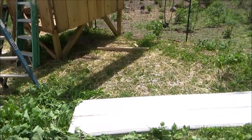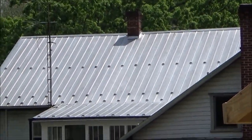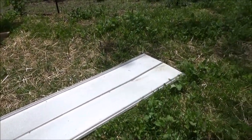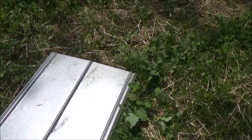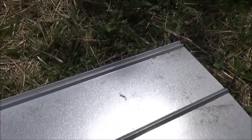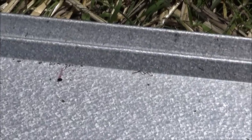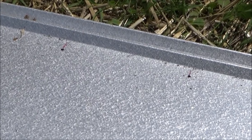This is some scrap metal that I had from the roof replacement years and years ago. Never throw anything away. So we cut these panels down to the 8-foot length we needed, and then we went through and pre-drilled the holes in the metal. That way it makes it easier when you're up there trying to get the metal screwed on — it's a pain sometimes when you can't find your screw holes. Bright, shiny metal.